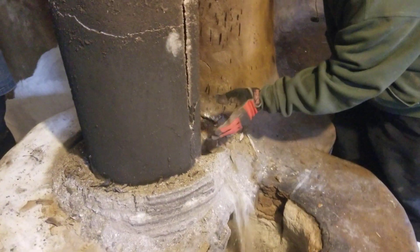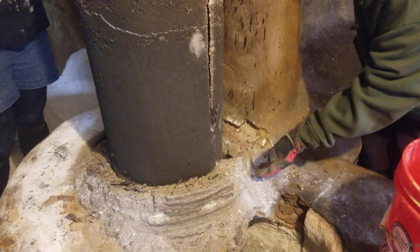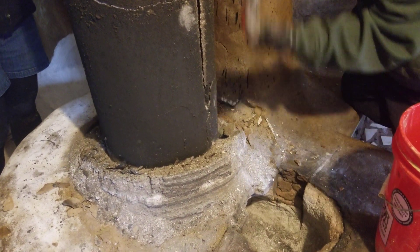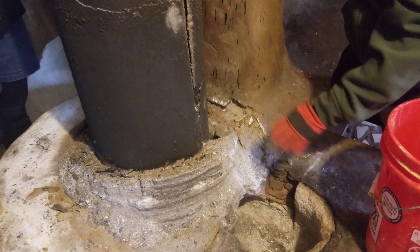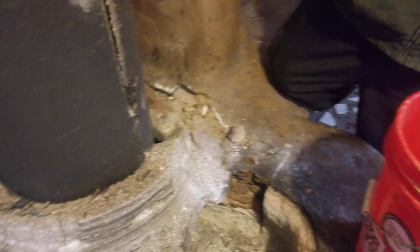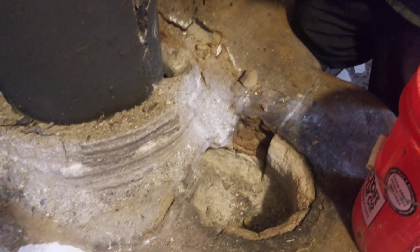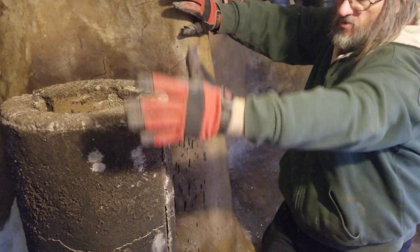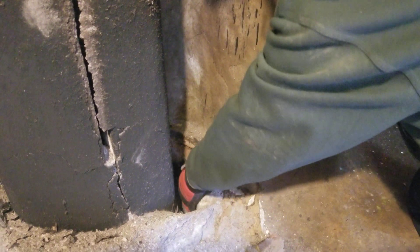This is all ash — there's no creosote here, but there is some ash from all the wood and from the cardboard and newspaper people have used to start it. That's ash from seven years. It also shows us where the exhaust stream flows: it comes up here and then circulates around the inside of that barrel. Because the output is over here, it would slide there and drop the ash on its way out.